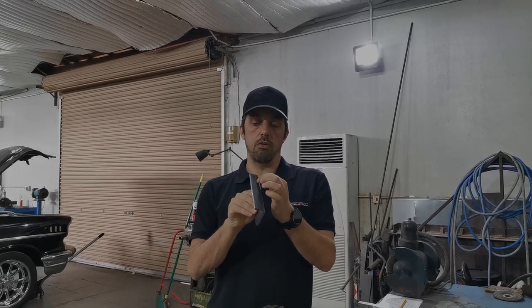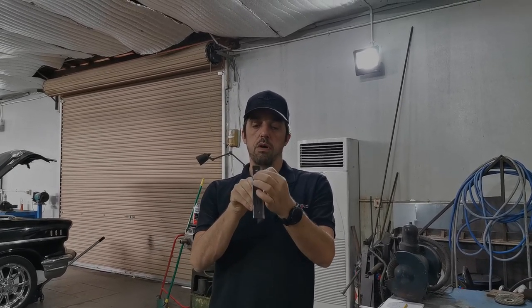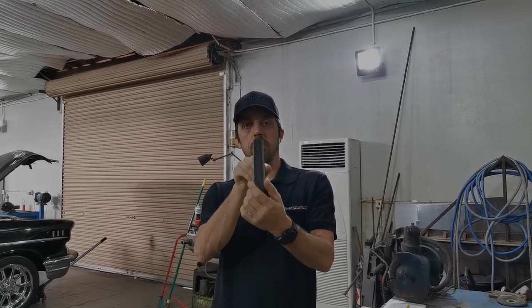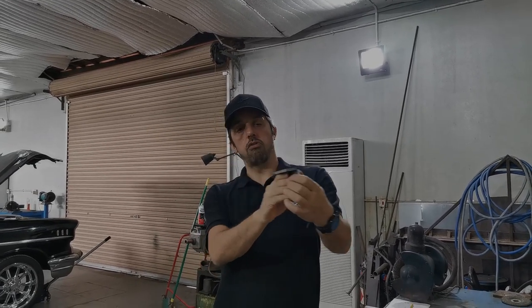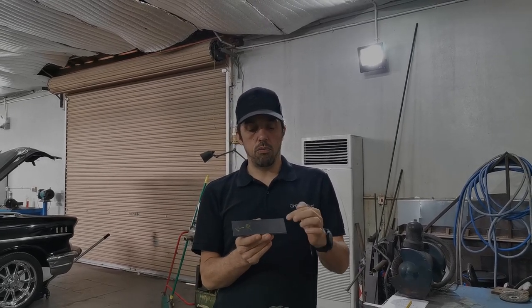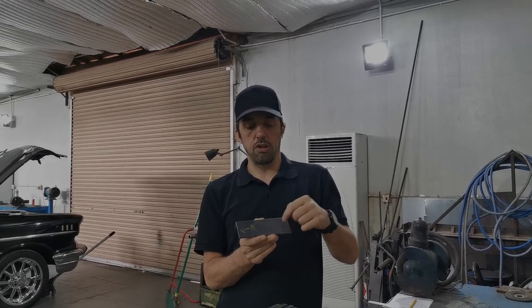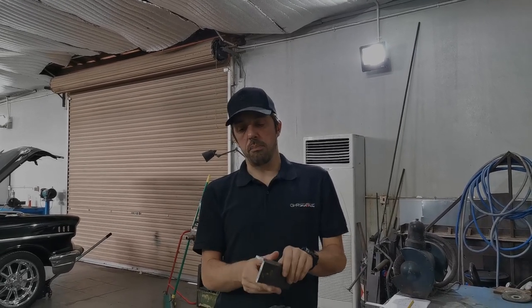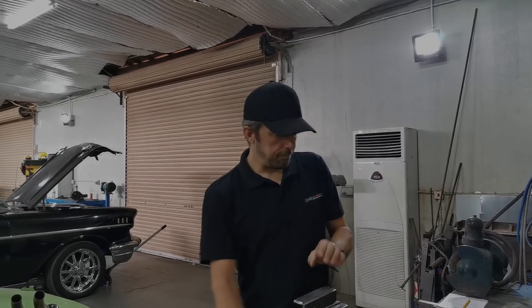So what I'll do now as well, we'll cut down with the 1mm cutting disc. We'll just take that channel out there, link the two holes together. I'll file it all down. Then we've got a nice runner that we can slide the bolts backwards and forwards to get that adjustment. So that's pretty cool, that's all done. Future for that as well is we're going to drill two holes in, pop some studs in, actually weld the studs into that plate, and then that's that part of the mount done.